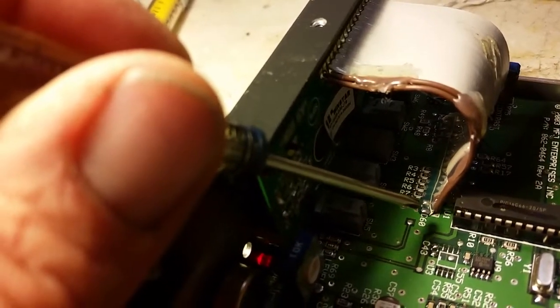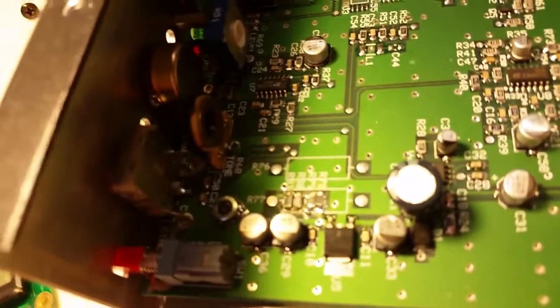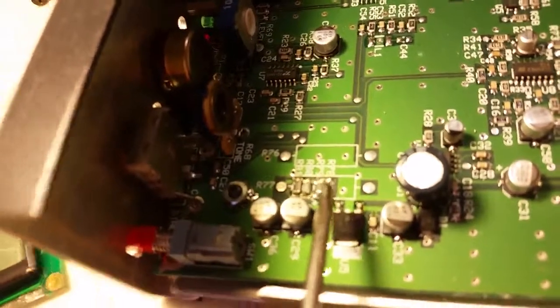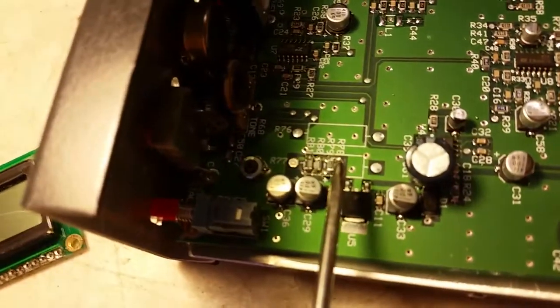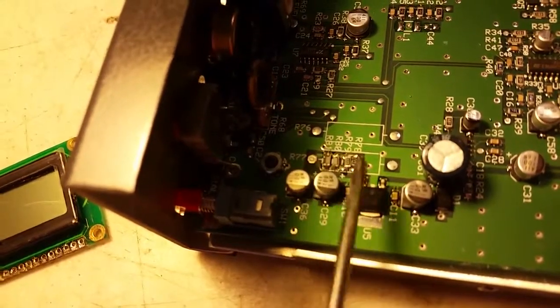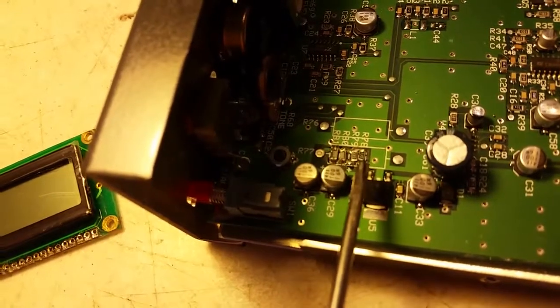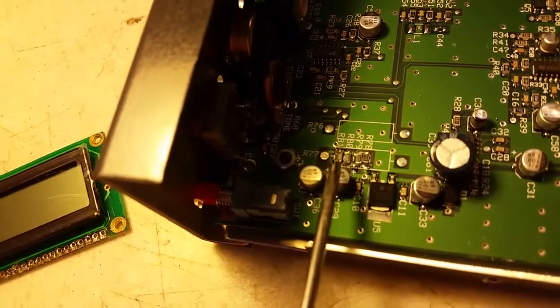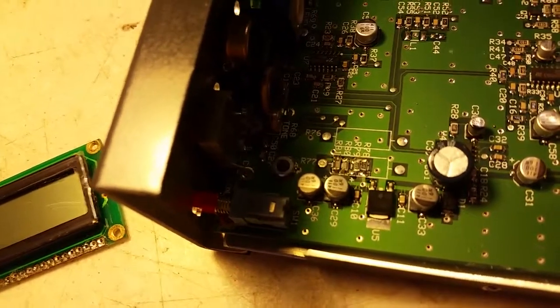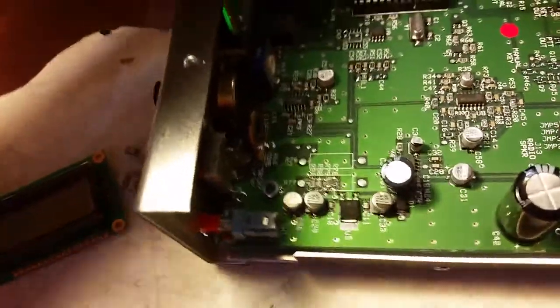MFJ did send four little resistors — R78, 79, 80, and 81 — little 220-ohm resistors. Had to put them all in. Can't say I did the prettiest job; they're about an eighth the size of a rice seed, so they're a little tough to install when you don't really have a proper setup and it's already been wave-soldered ahead of you.